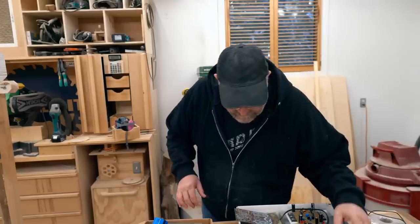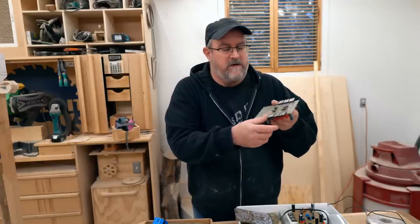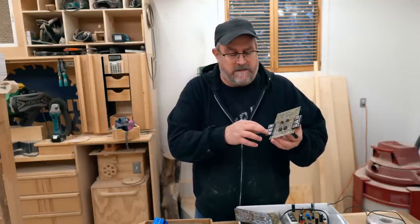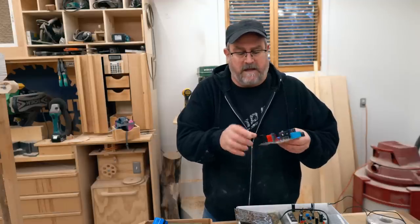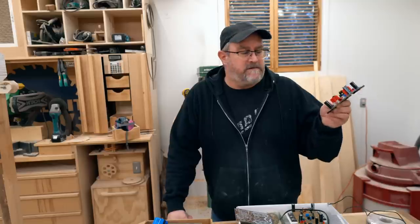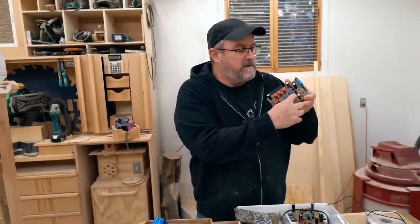Here's a board that's already put together and working. You can see the output transistors have five leads coming out of them. Three are the normal ones — base, emitter, and collector; these are BJTs. The other two are for a diode that's on the die itself. So you have bias control through these diodes right on the device itself, which is very accurate. You need a way to adjust it, and that's what this trim pot does.